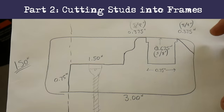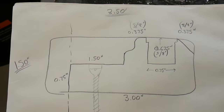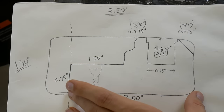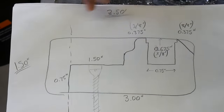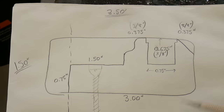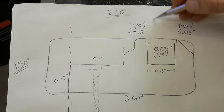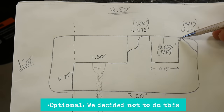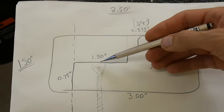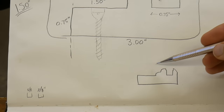Here is a side section of the stud with the crazy shape that is our window frame inside of it. To match the windows on the house, we want them to be three inches wide. Since a 2x4 is actually only three and a half inches wide, we can just cut half of an inch off to match that. They're only one and a half inches tall — that's worth noting. We'll do a few cuts to get this section out, then run multiple passes through the table saw to get this groove out, and do a couple passes with the router. There are also small slots we'll cut for caulking to get a seal, and screws that will be hidden by a little piece of dowel. The end result is going to look something like that little piece right there.